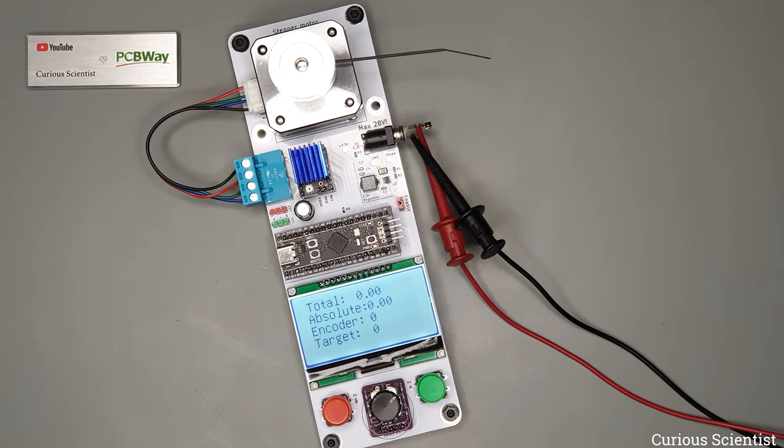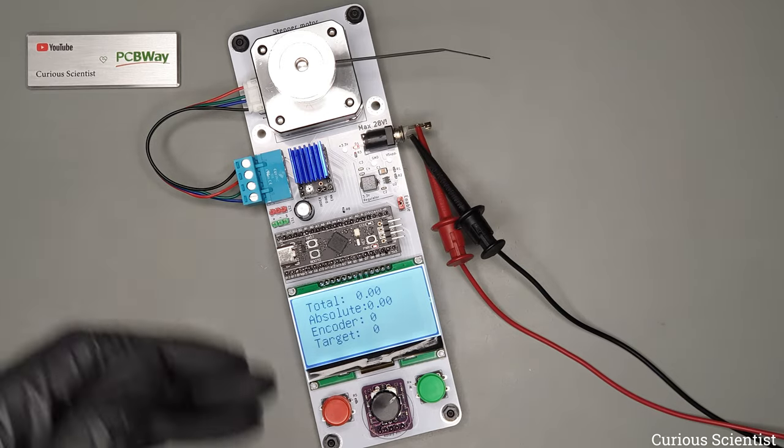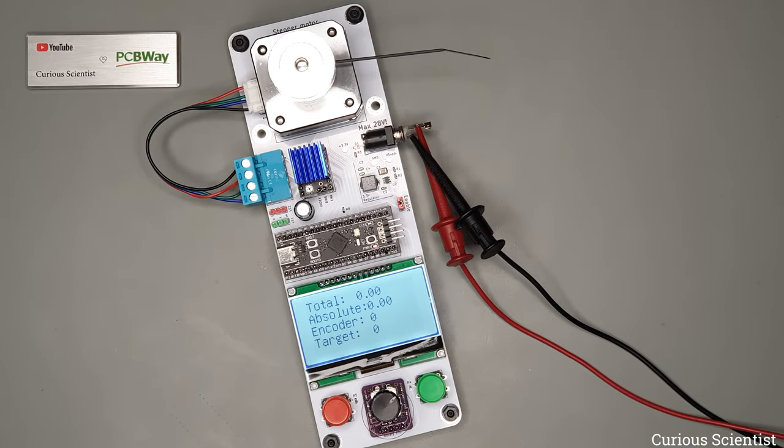And in ideal cases, you would not need a PID controller for a stepper motor, because if you send the stepper motor to a certain position and your system is properly sized and implemented, then the stepper motor should be precise. You can think about these 3D printers. They don't have any active encoders or similar things, but they can print for days without making any mistake, and you will get the perfect stuff out of your 3D printer.